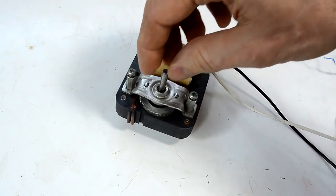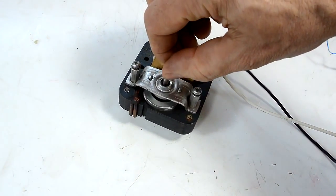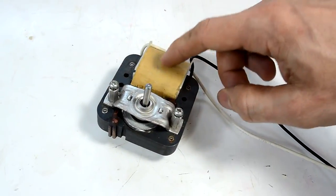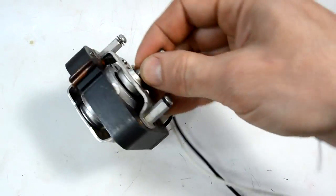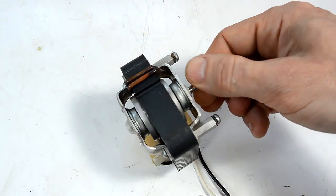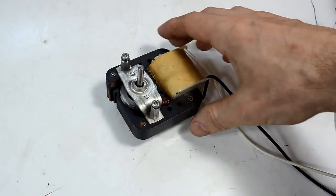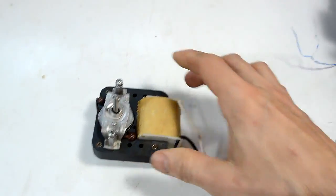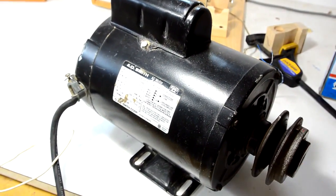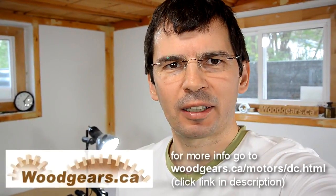For things that need to run quietly and reliably for a long time, we use induction motors. This is just a simple shaded pole motor, much like the one that would be used to power the fan inside the freezer of a fridge. If you look here, there is a stator with a coil on it, but there's absolutely no electrical connections to the rotor - so no brushes to make a lot of noise and get worn out. Induction motors vary from the very small to much larger - for example, this 2 horsepower motor for powering larger tools. In many ways, induction motors are actually simpler than universal motors, but the theory behind them is much harder to explain, so I'll cover that in my next video.